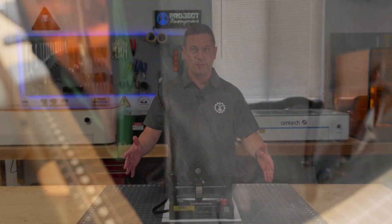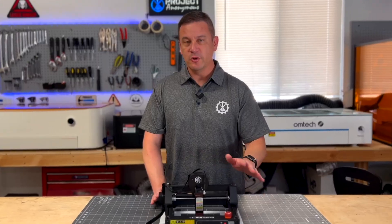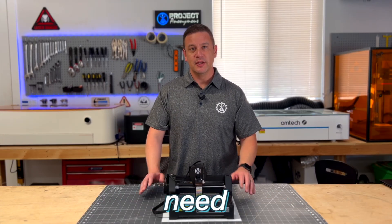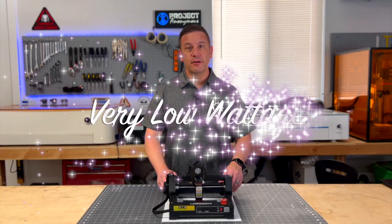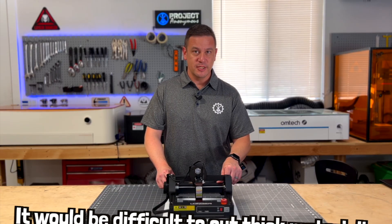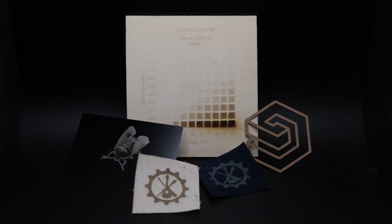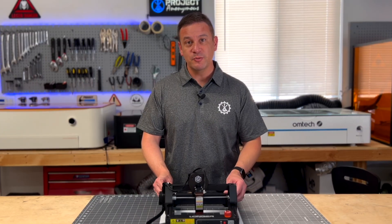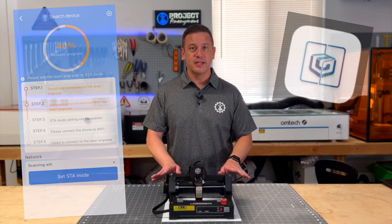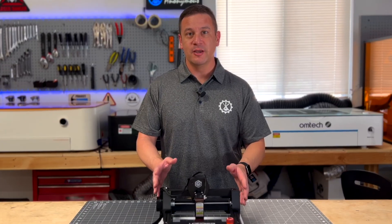The fix is that while framing you can just remove the cover since it is magnetic, frame out your material, then put it back on before engraving. Alternatively, you could use a protective enclosure and leave the cover off completely. This wouldn't deter me from purchasing at this price point, but it is something you need to know. The machine is also very low wattage at 2.5 watts, so cutting through thicker materials will be difficult. However, with this low wattage you get precise engravings on fabrics and delicate items. Another incredible feature at this price point is built-in Wi-Fi with an app — you don't even need a computer to use it, which you definitely don't see with other lasers at this price.